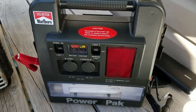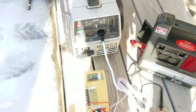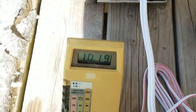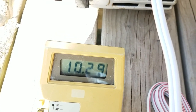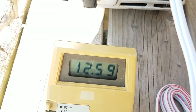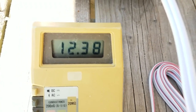I've got something different now — my Marlboro power pack, a 12-volt jumper pack with a 12-volt lead acid battery in it. Let's hook it up to the DC output and use it to charge the battery. Someday I'll have to put an oscilloscope on the DC output when it's connected to a battery to see how much reduction in the ripple there actually is, and how suitable the DC output might be to run sensitive equipment like a CB radio or an amateur radio transceiver — maybe out in the field as long as you've got a battery connected to it.